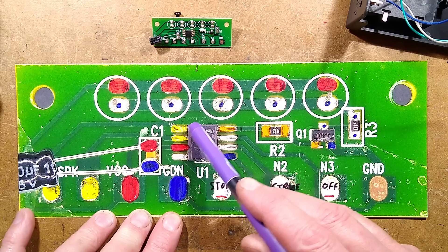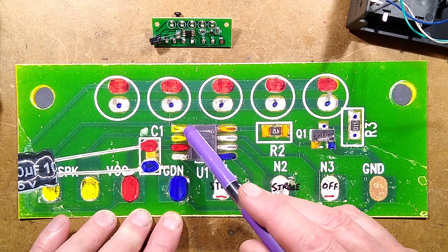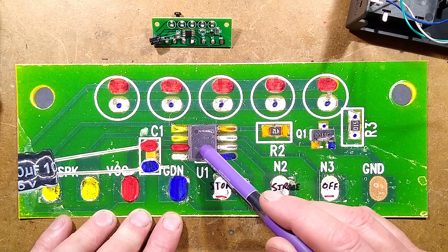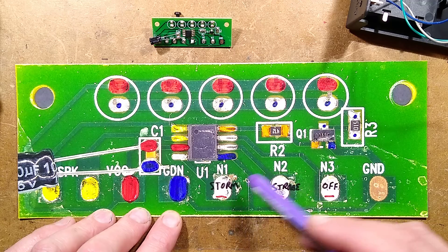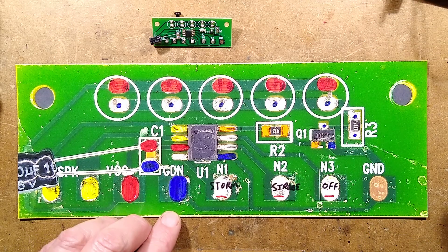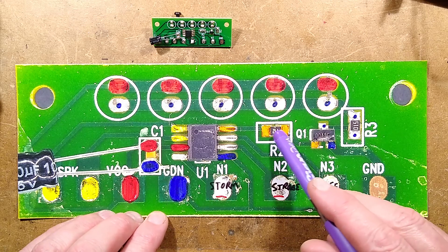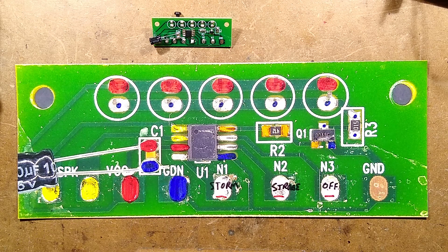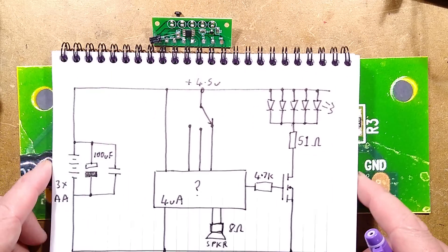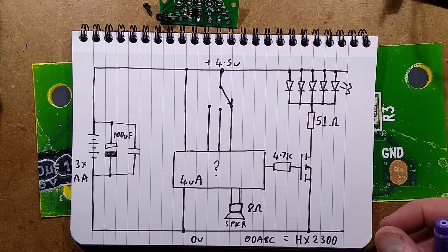It has two outputs in that chip going directly to the speaker. I wonder if that's just data lines or if it's actually got an audio driver in it. Maybe it's a dedicated-purpose chip. It does appear to have three logic inputs, and I get the feeling this is a universal circuit board used for other things, because there's a very strange bit in the circuitry. I'm wondering if the 4.7K resistor is to allow the use of an NPN transistor, but they've used a MOSFET. They're so common these days — let's just stick one in. It has advantages.